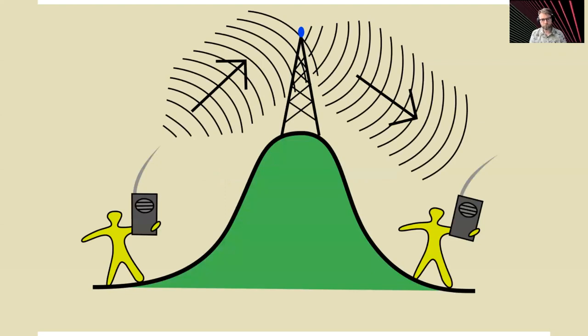So what's a repeater? We have these little tiny handheld radios, and they can get our signal maybe a block or two to another person. But if I want to use my handheld radio to go 50 miles, how am I going to do that? Different radio clubs will set up a repeater, which will take your signal and rebroadcast it on a slightly different frequency, propagating your signal much further. The local club in my town maintains a repeater and we have regular nets where we talk, enabling us to reach pretty far out when normally I'd be limited to just my local neighborhood.